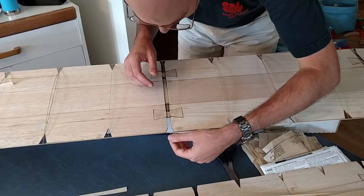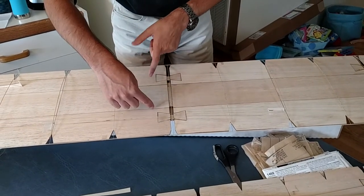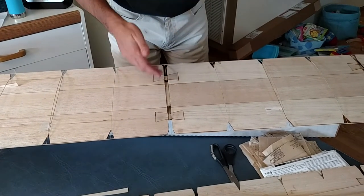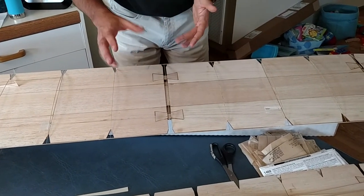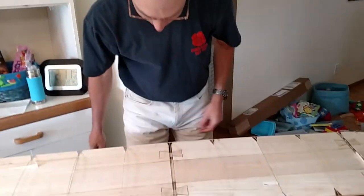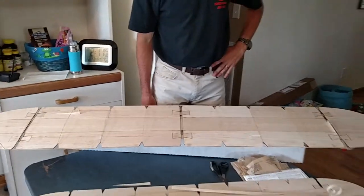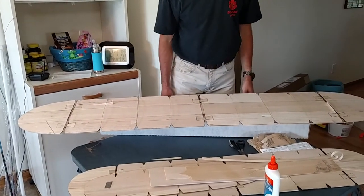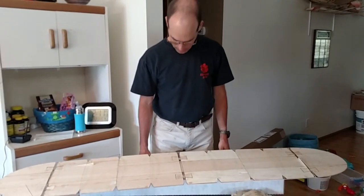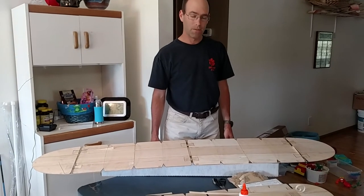One of the consequences of laser cutting is you always have to account for the width of the cut. Since this form has three cuts, it comes out narrower than intended. Even though I tried to factor that in, I got it a little wrong — off by about almost a sixteenth of an inch. So this rib is kind of under compression, but anyway, there you have it. This is a fully assembled wing; the slots here are for your compression ribs to be built in place. This wing will be dry in another five minutes and I can take it off and weigh it.